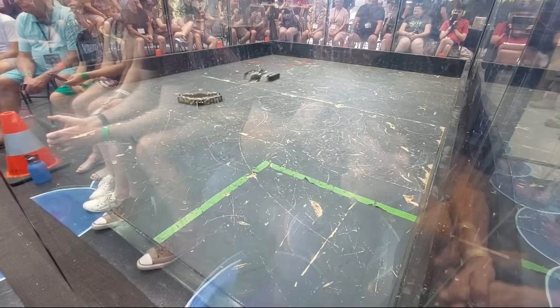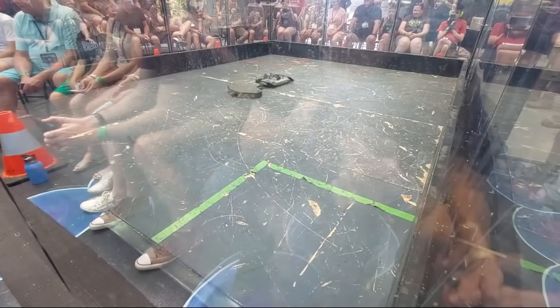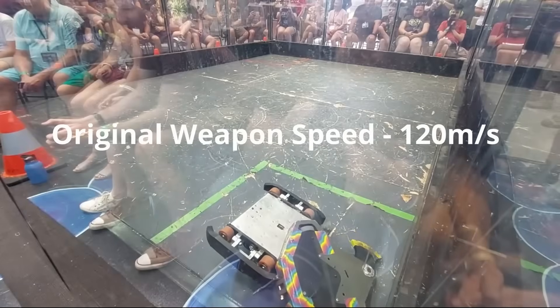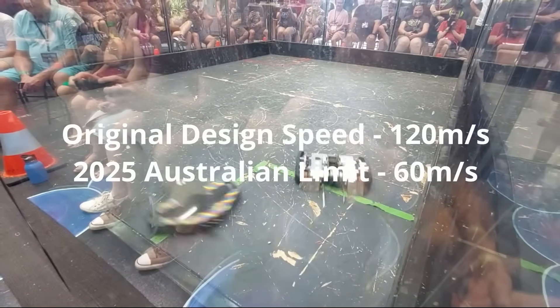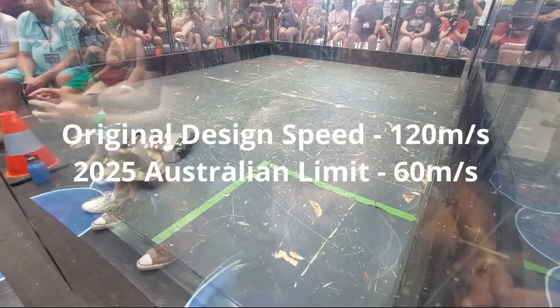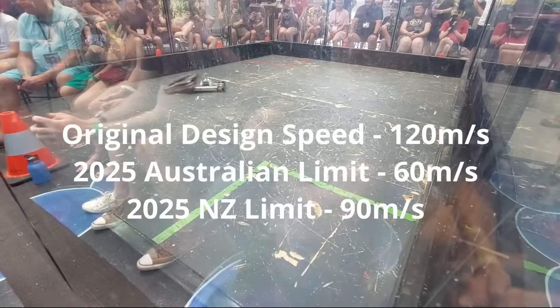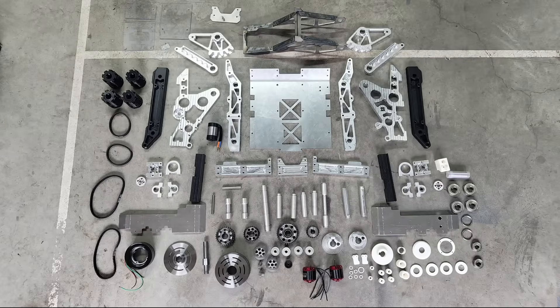With an inventory of the old machine, we need to set goals for a redesign. Primarily, the objective is to hear the weapon gear motor run at full power in combat. Australia has a rather low tip speed of 60mps since I started the hobby, which is half of the original design speed, leading to Angus running an outrunner system instead. With the New Zealand limit of 90mps, I'm confident one can use the original system with a few modifications. My other featherweights have been typically made with a large number of simple parts, whereas here I want to try for a small quantity of complex parts, with as much recycling as possible.